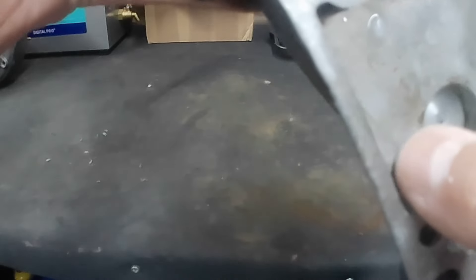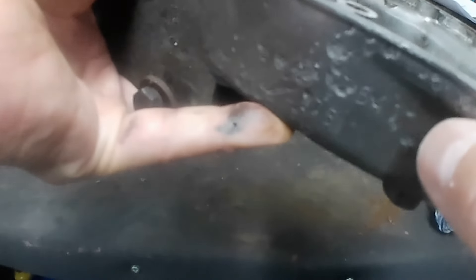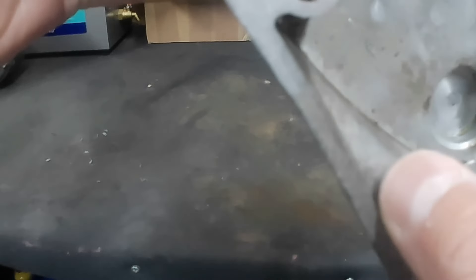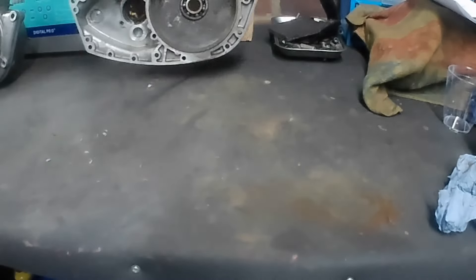There are lots of smoky black deposits — loose juice, as it's sometimes called in the aircraft industry — when you're looking at fretting components corroding due to fretting. We've had a corrosion pit that started to crack, some expansion and contraction of the pieces, fretting corrosion, and the crack is just running and running. End of the road for that case.